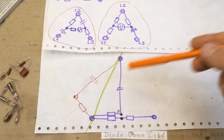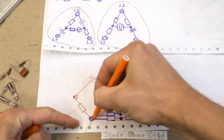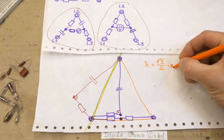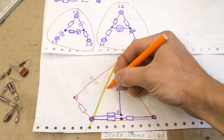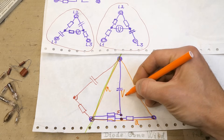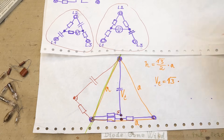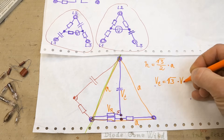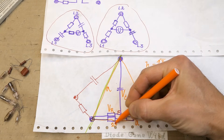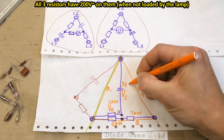The components have to be calculated for the correct voltage ratios. This is essentially an equilateral triangle, where the height is √3/2 times the side length. The voltage on the capacitor is √3 times the voltage on the resistor, which is half of the phase-to-phase voltage. In Europe there is 400 volts between phases, so the resistor has 200 volts on it — and so does each of the other resistors. That means the capacitor has about 346 volts on it. All voltages are AC, and when loaded with a lamp the voltage between points can be lower.